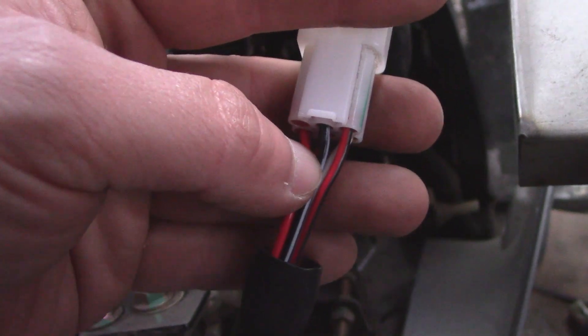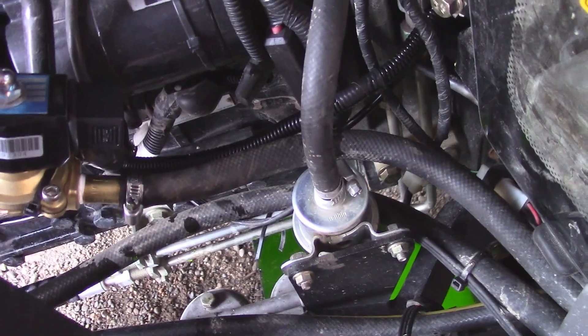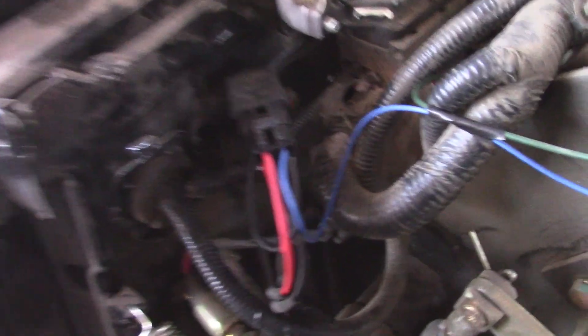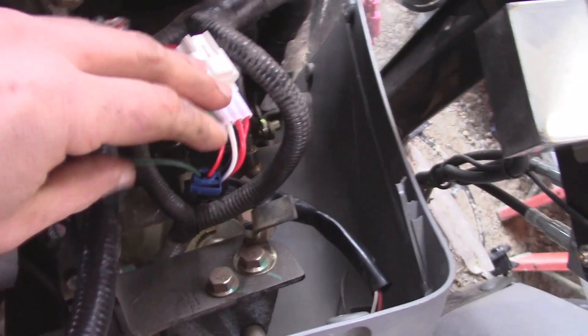Here's the finished-ish product. Starting from the front, I've got 14-gauge wire on a ring connector with a sheath. Over here at the solenoid it's all wired in — I have shrink tubing and wire loom. They both roll up through here, through this grommet, and up to this relay. This relay is actually part of the kit that came with a light bar I put on the Ford, so I just hacked it up and repurposed it.